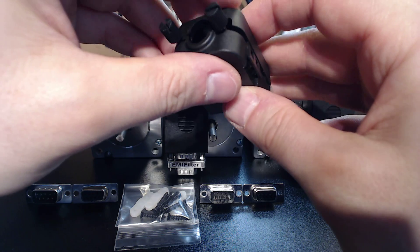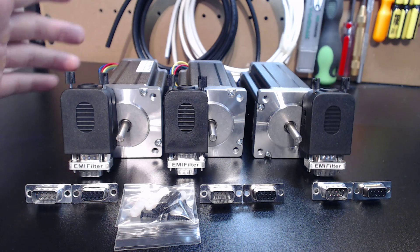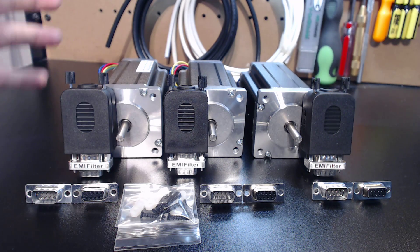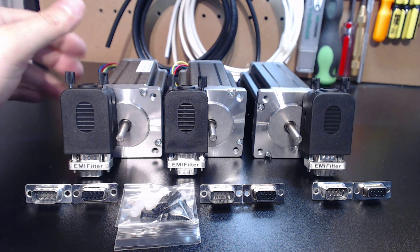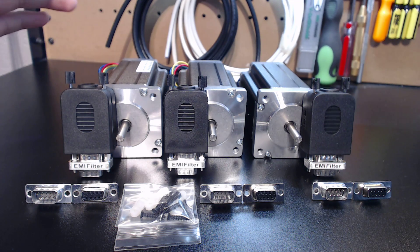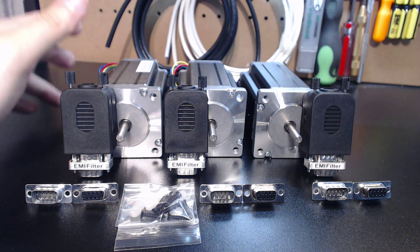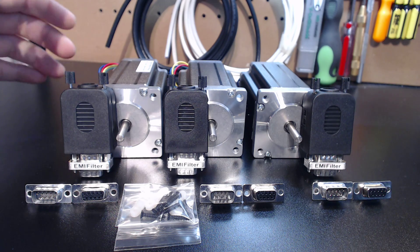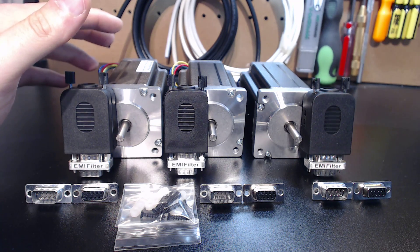The questions I usually get when it comes to motor selection — first of all, what size do I need? The packages I'm offering are going to be configured stock in 3 and 600 ounce. That pretty much covers the gamut of what you'd actually run with the G540. However, there are times you may need a larger motor, but 9 out of 10 times most of my potential clients think they need a larger motor than they do. 600 ounce motors are very, very strong.